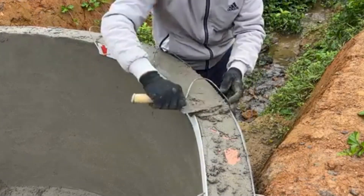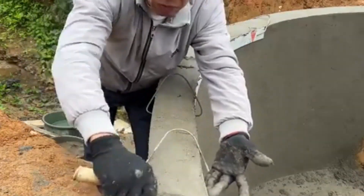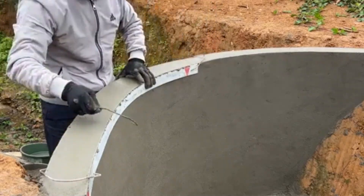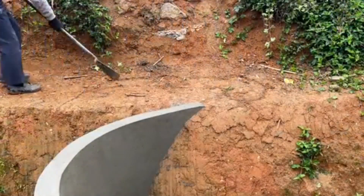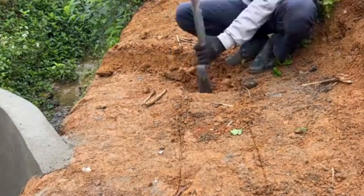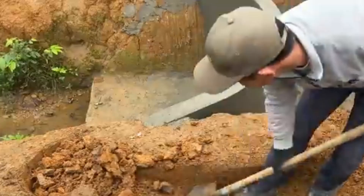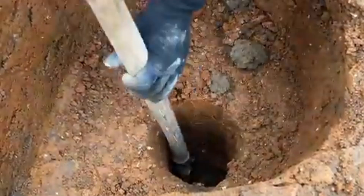Next, I bring in the sandbags I've prepared in advance and stack them layer by layer, forming a curved shape, or an inverted V, so the water is funneled toward the middle and directed through a spillway that I've designed. Each layer of sandbags is arranged in a staggered pattern, alternating with large stones and compacted soil to increase strength and prevent water from seeping through the dam body.